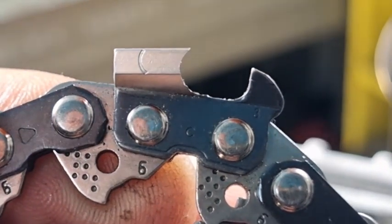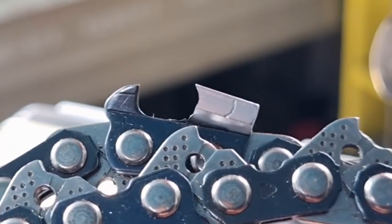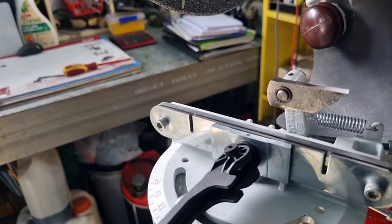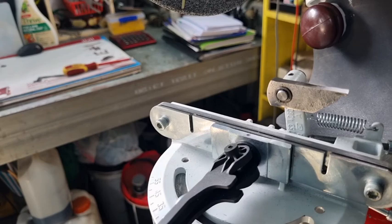Looking at the other side of the chain — same result. So that's 10 degrees downward tilt on a USG grinder. The most important thing is to get the wheel dead smack in the middle so that the grind to the left side and the right side is equal. Nothing worse than having a wheel that's worn and not centered. That's why I still recommend minus 15 positive 15, so that any error in the wheel alignment is overridden by that minus and positive 15, as I showed you before. Thanks for watching, bye for now.